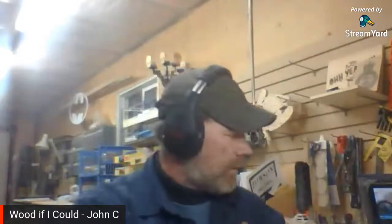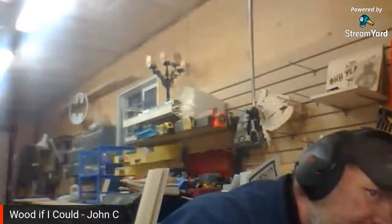It depends on the hardness of your wood. It depends on how hard you're pushing your wood through your blade. It depends on a lot of factors. It depends on the manufacturer of the blade, whether it's forged steel or pressed steel, your tooth counts, if your wood is wet, how dry your wood is, what wood, how long a cut you go. It depends on the person cutting too, because some people have a really hard push when they're cutting. Some people don't push hard enough, and you'll go through a lot of blades. It depends on your tension as well. With spirals, you want a lot of tension. See, I can't even finish this off. Like me, sometimes I get too impatient.